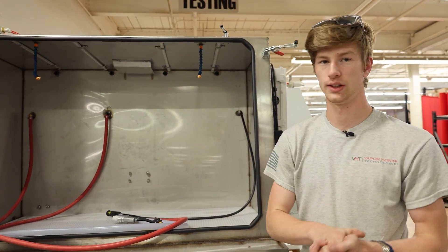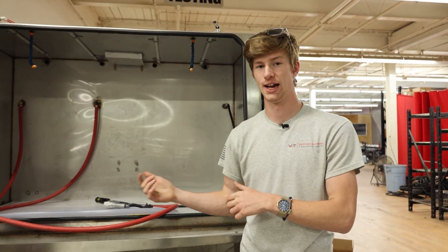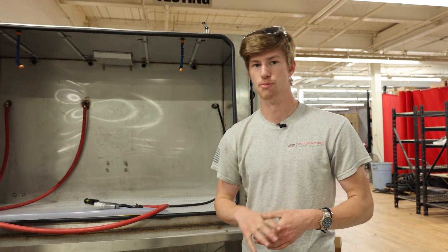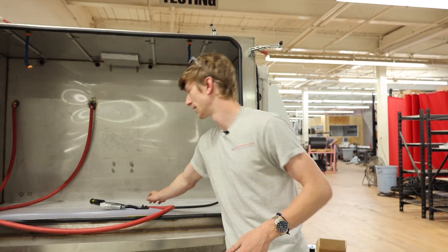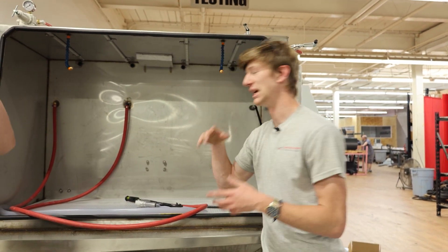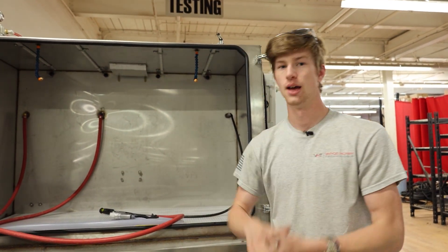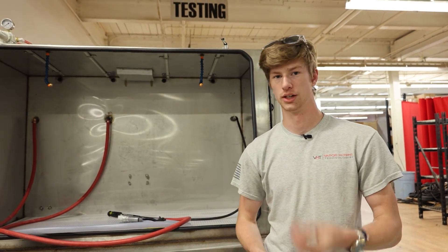Now, this one here is specifically set up for soda. Soda is water soluble, so you're not going to have to worry about leaving abrasive in your parts. And it does a very good job of getting it back to that base metal. It does struggle at removing very caked-on corrosion. It's great for removing things like grease — and that's actually where the hydro blast comes in, because this is heated. Anything you're going to encounter on a car or large truck, this thing is going to take it off, minus things like paint. It will struggle with that just because soda is such a soft abrasive.